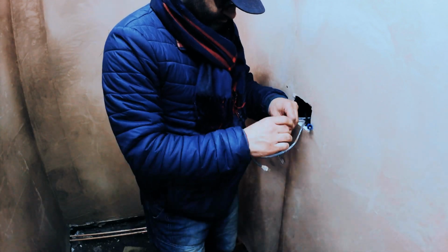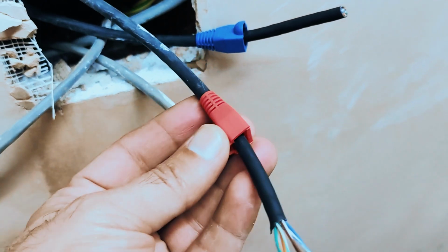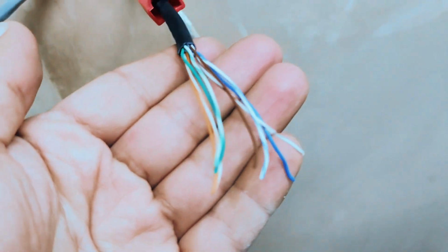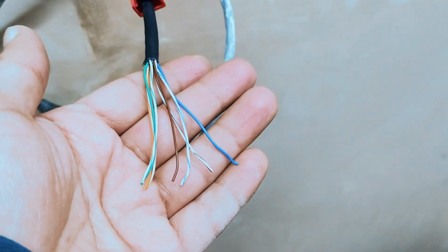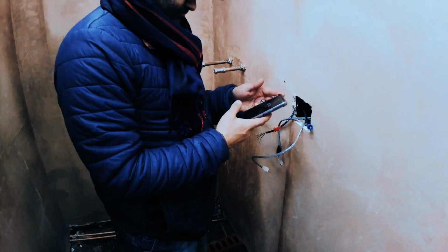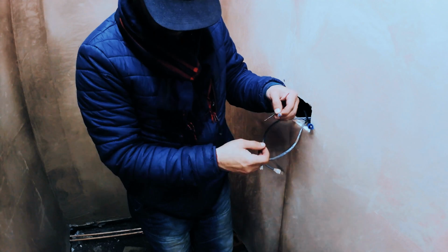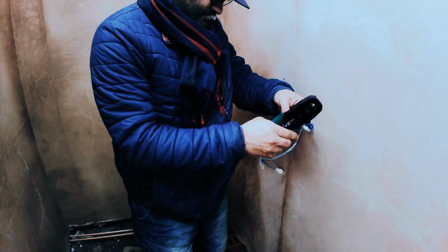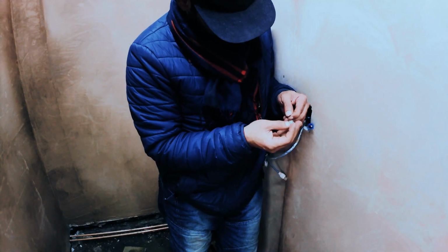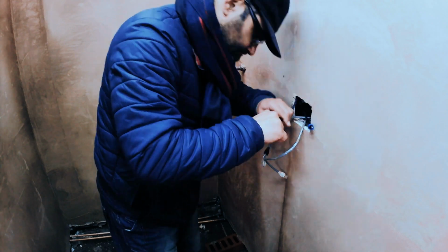So this episode, you're seeing a number of techniques being done. The electrician will do his bit. I'm doing the internet bit because this doesn't involve any electricity. You'll see I just got the cables out here. You'll have a set of cables in their different colors. Have a look online if you're not sure how to do this. There's videos online. So what I do is I have a picture to show me which colors I need to put in which order, and I refer to my phone to look at that picture, and then I push them through on these open-ended jacks. These used to be a lot harder. They're a lot easier now because you can push all the cable through and just cut off the extra bit. So these are basically jacks.